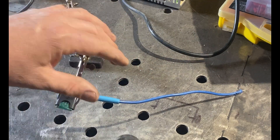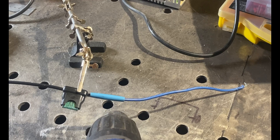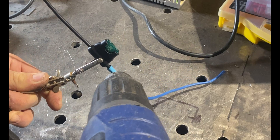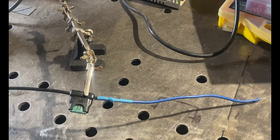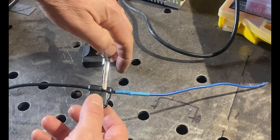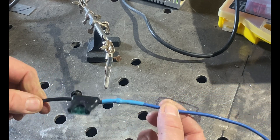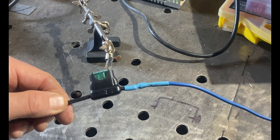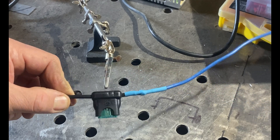Use extreme caution. On the 12 volt side, all bare wire connections also need to be kept from each other — no bare wires making contact. I'm using a heat gun to shrink the heat shrink. You can use a cigarette lighter, but a heat gun is excellent — nice, clean, and pretty much fumeless. That gives us a good strong protected coating over our solder joint. All this stuff was covered in the tools-needed video early in the series.